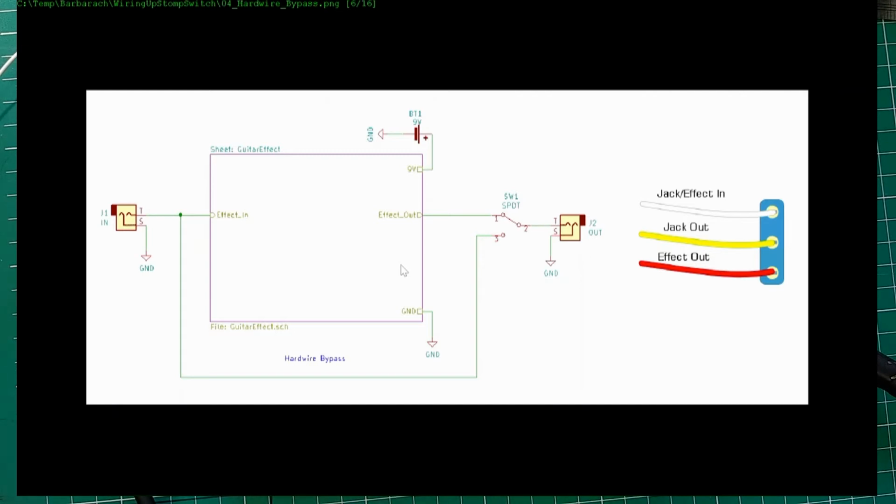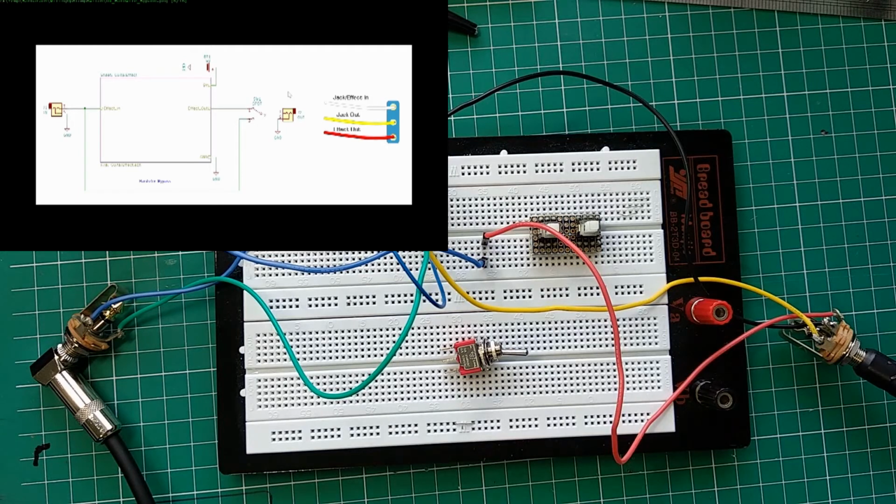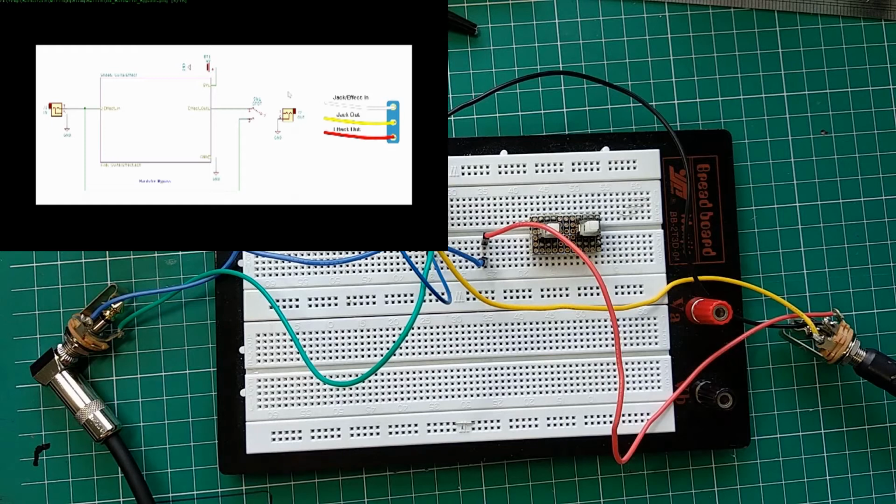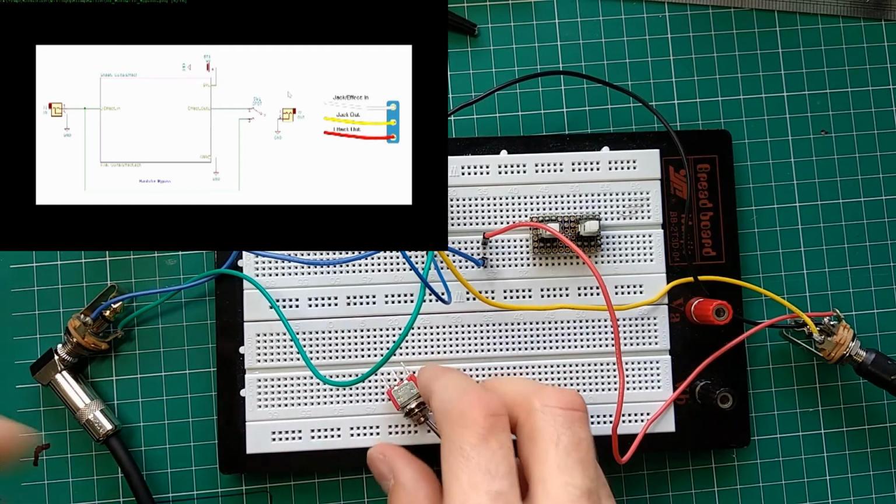And this is the way it's working, for example, inside a Boss pedal, but again, you have bypass, you have a buffered input, which isolates the guitar, and you have a bypass buffered output, which isolates you from the next pedals in the chain. So it's a bit different in Boss pedals, and it's electrical. But if you imagine that electrical switch being actually a switch like this, that's how it would work. So let me demonstrate that this is actually going to work.